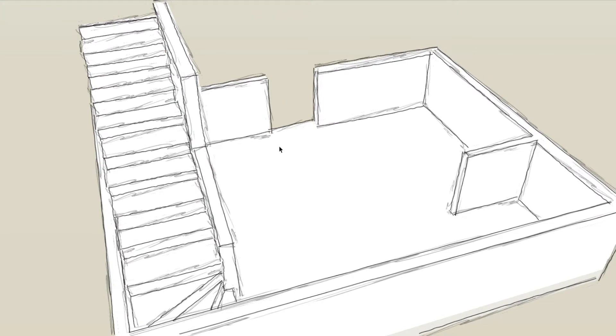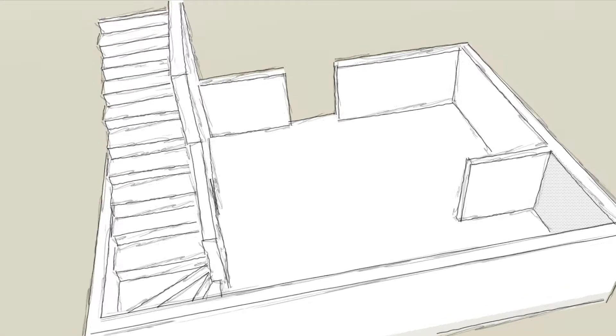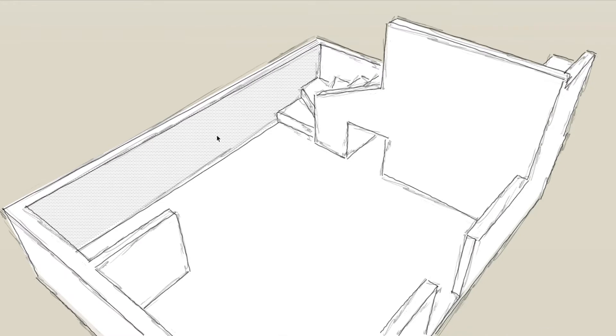According to code, we need an electrical outlet on any wall that's wider than three feet. So we'll need to put an outlet here, and we'll also need to put an outlet on the wall here — but we want to make sure we keep it far enough away from this opening to eventually maybe put in a sliding barn door. We'll need an outlet on this wall here; that'll be above the countertop and that'll be the GFI. This one here is actually slightly under three feet, so no outlet is required. In behind here there's an outlet for the washer that's on a separate circuit, so that'll cover that area. On this wall, one outlet will be sufficient — we'll put it somewhere in the middle.